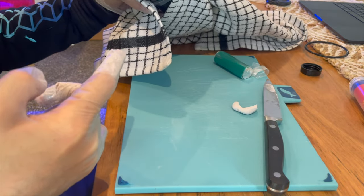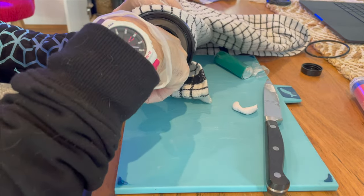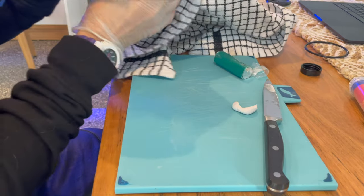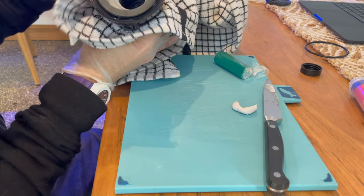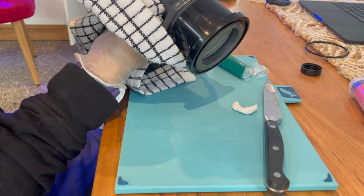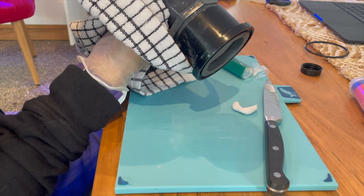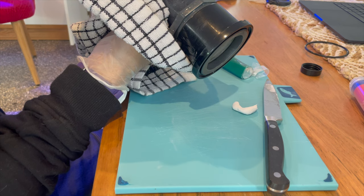And that's the easy one. The next one now is going to be at the other side of that fitting. I'm going to be forcing the putty into the joint on the same fitting, but on the other side. I think that's a less likely point of water ingress because it's further away from the joint that's leaking. I would suspect it to be leaking from this joint up here if it was leaking from that side of the conversion fitting that's internal in here.